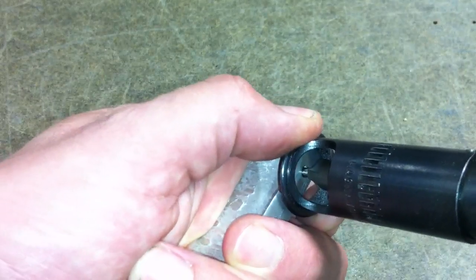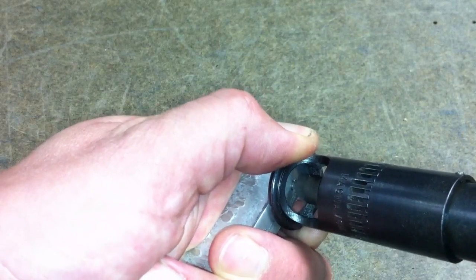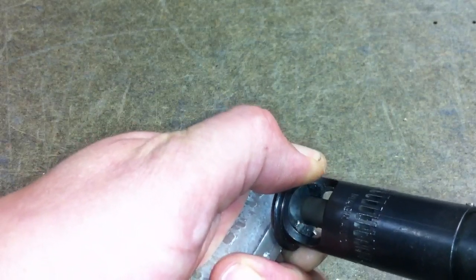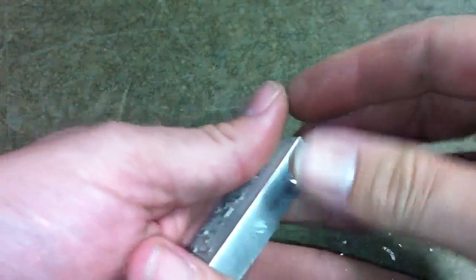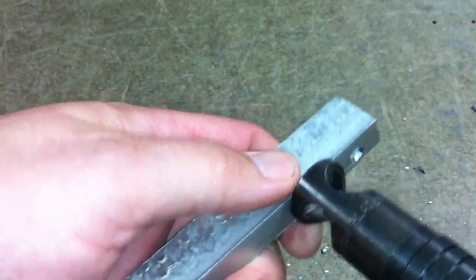Hopefully you can see what I'm doing. I'm turning it fairly slow and pushing fairly hard. Now if I was using a cordless drill, this would be easier — you'd have better speed control and the torque on the cordless drill is obviously much better than on the air drill. Now in the background I'm changing countersink cages. I like to leave one set up for a number 40 and then change it for everything else.